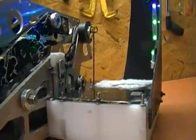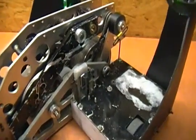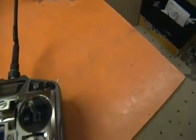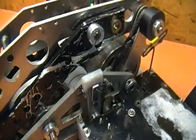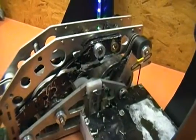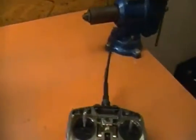Naturally that should trigger the flip, but it doesn't unless I've been spinning for a long enough time. So here I'm going to notice I didn't actually move anything there. I'm going to throttle back up and make sure I turn on my artificial intelligence, and then when I hit the bump sensor it'll actually fire the weapon. So I'll let that spin up again. It won't do it unless it's been spinning for 3 seconds since it flipped. And then here I'm going to hit the bump sensor, and you can see the weapon will actually engage. And throttle back down.